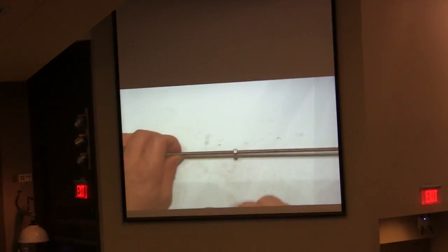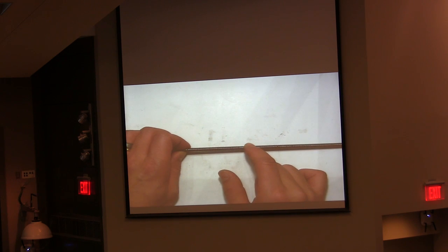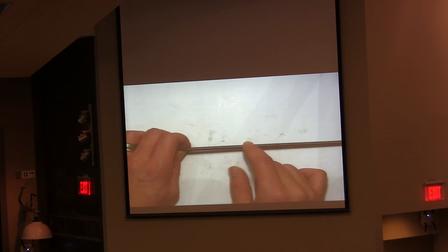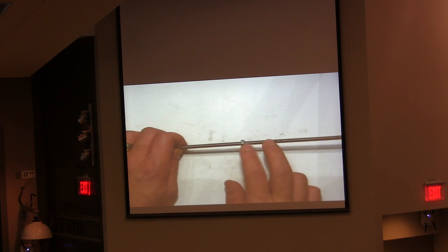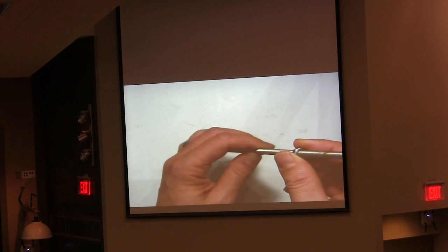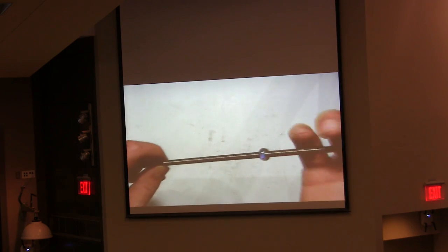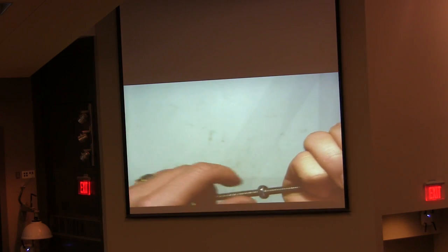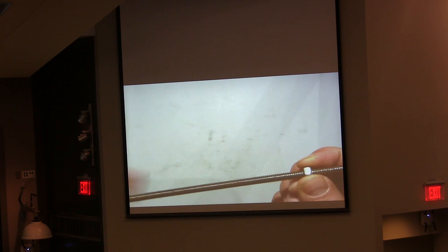Threaded nut. It's not ideal because this threaded rod and the nuts are designed to lock things, not transmit power. So friction is not great, but when these two are both rigid, like steel, that's actually okay. So I recommend using a nut to convert rotational motion to linear motion. Some people use a plastic piece and thread it inside using a tap. It feels smooth, but when you apply forces, the friction goes up pretty high. So I recommend using a nut rather than a plastic piece.